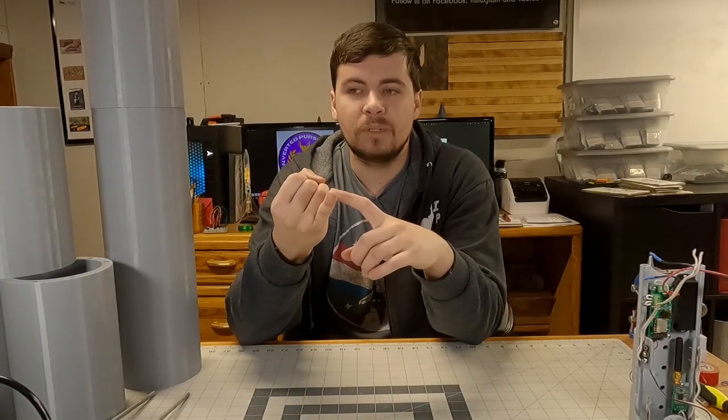The other thing I'm working on is my electronics bay. I prototyped my eBay for Festus and this has been the final design I wanted to move forward with onto Praetor. Festus will also fly again with this version. The previous one had a failure in the final flight where a chunk cracked. I'll have this sled with two 3D printed bulkheads and all-thread running all the way down. A metal strap will run between two bolts, allowing an eye bolt out the center to transfer load through the all-thread down to the other side, with an identical printed cap, steel strap, and eye bolt. The threaded rods are a little short for the current design, so I'll have to cut new ones before flying Festus again.